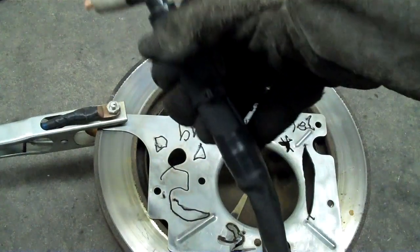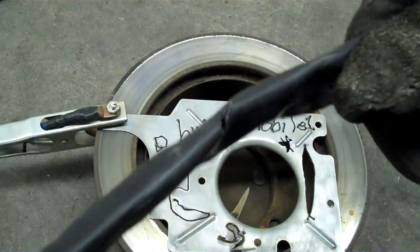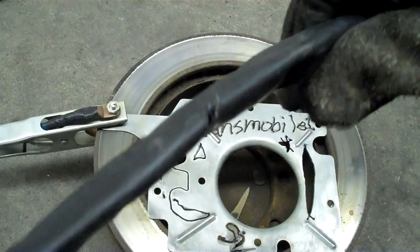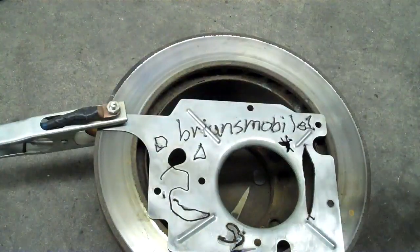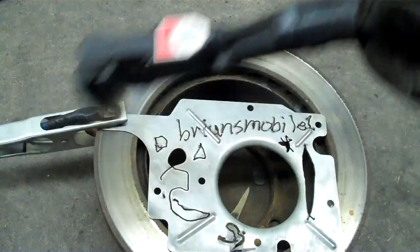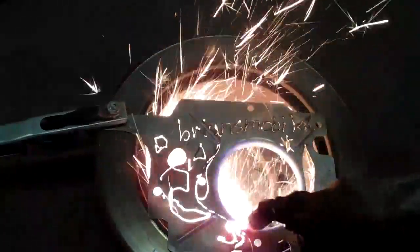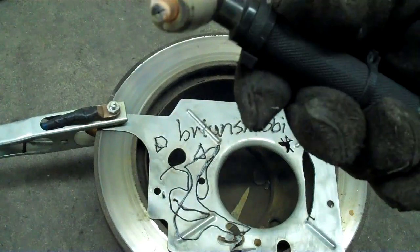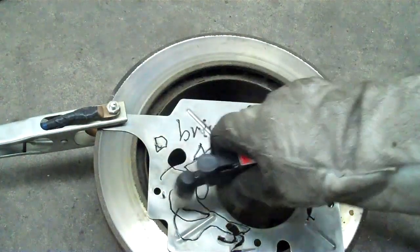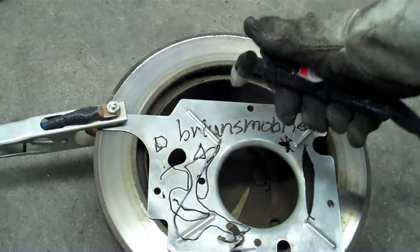The deal is that the air thing came off, and even with me crimping the air thing back on, I melted this cable jacket housing. You can see it's got a little burn mark through it from before, and it's puffing out air — so even still it doesn't have a very good connection inside of there. I'm sure if I shore that up it'll be better. Look at the tip — it's still just a teeny little thing; I'm dragging it all over the surface. It didn't have sufficient airflow, and that's why it would just arc and blow out the tips. If you go fast it just burns it — you've got to go slow enough to go all the way through. I'm only at like 30 amps. Look at the backside of this thing — oh, that is so much better.